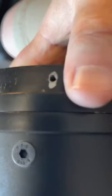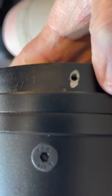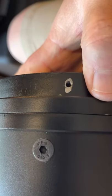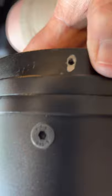I was able to just shake this around before — now it's as tight as it can be. I'm going to do the same thing with these little holes here that go with these little screws. I've got the size 6 M thread tap, so I'm going to size them up, tap them to the larger size, and then countersink everything over here on the mount.